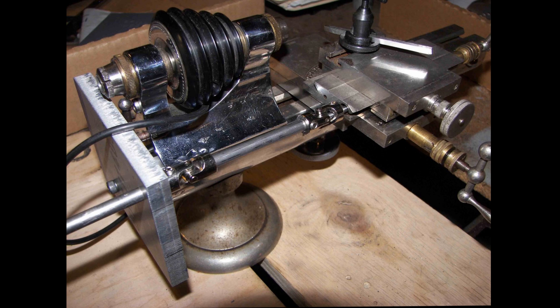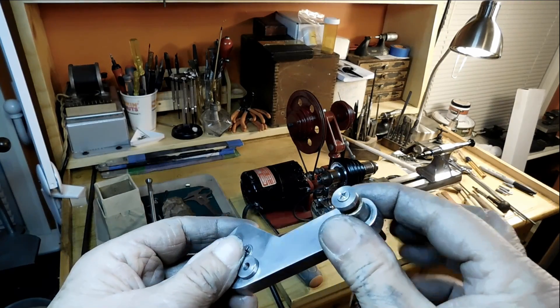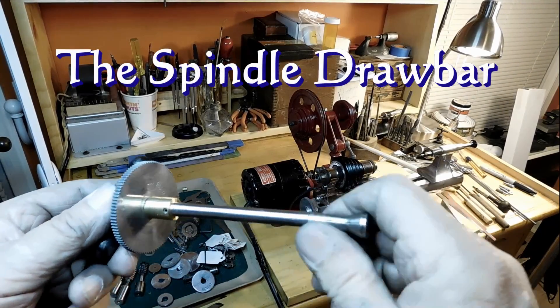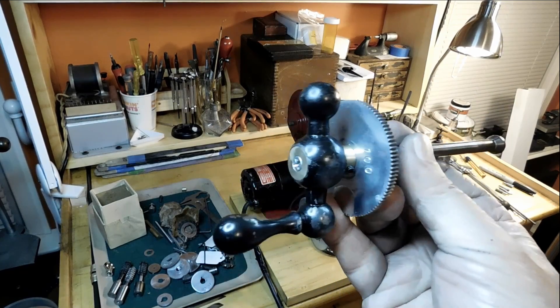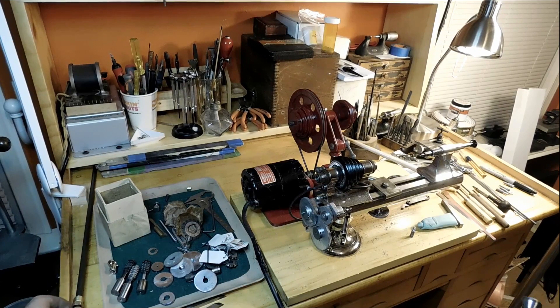Here you can see the extension. I put it on some couplers that I bought — they were for an RC motor boat, and I got a bag of them for pretty cheap. Made a little way to connect the lead screw to the piece of aluminum on the end there. That piece of aluminum is soon going to be the banjo — here it is all cut to be the banjo. Down at the bottom you can see two pieces of drill rod for holding the arms, and there's the bearing for that. It's held in place by a pin and just one Phillips head screw. There's the spindle that goes through the draw bar, through the spindle, with the collet on one end and the handle for turning, and the number one driving gear — it was made out of an auto brake line, pretty cheap to make. If you try to buy a draw bar for a watchmaker's lathe they're quite expensive, but you can make them with an auto brake line.